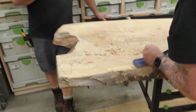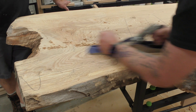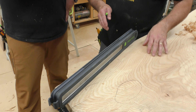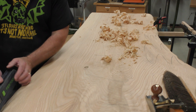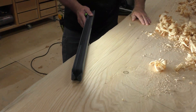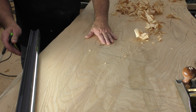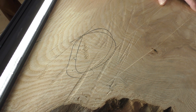You're doing great, Big D — thanks for holding the board down. Big D, thanks for bringing an inspection light. These things are worth their weight in gold. We had some heavy tear out down here and we came down and looked — it is eliminated. We've got some plane tracks, but we'll work those. It's wacky grain; a Rotex sander can take care of that.